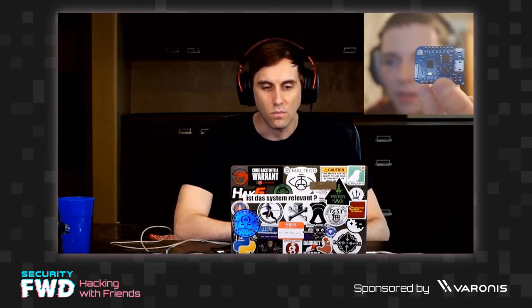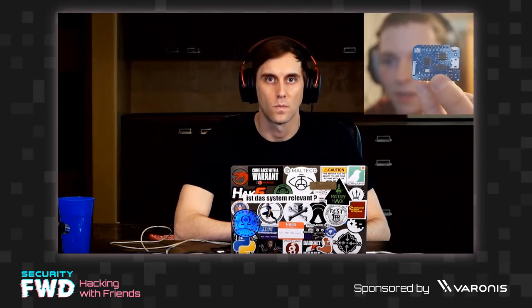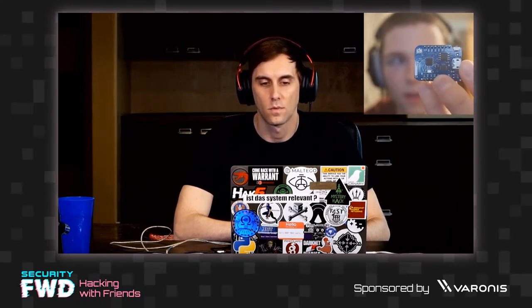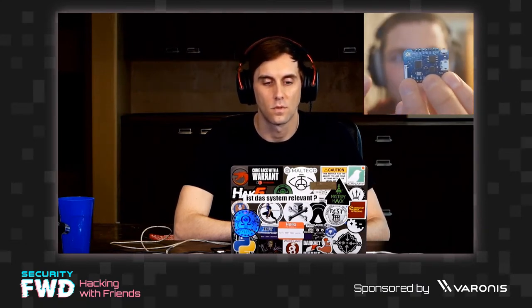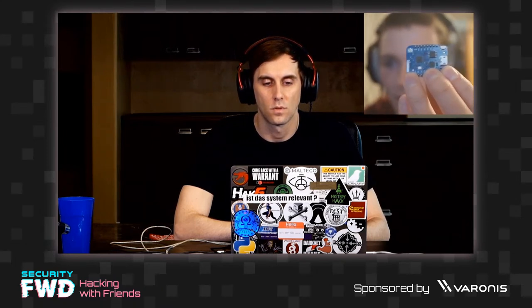So that's also how you program it. You connect it over USB to your computer. While the chip itself doesn't have full control over USB, you can do a lot of fancy stuff if your microcontroller actually speaks USB natively. But it offers a serial connection. That's how it's flashed, over serial. So these development boards come with a USB connector that has an extra chip on here. That should be the smaller one, this one. That actually translates the serial connection the Wi-Fi chip has to USB, so that when you plug it in, you can talk over that serial connection, but through a USB cable with the microcontroller.